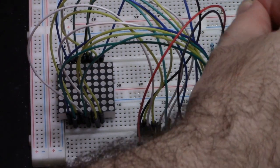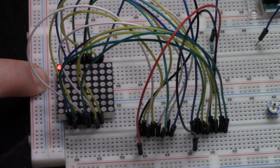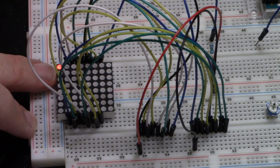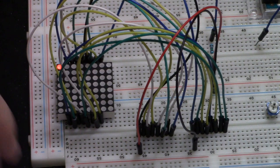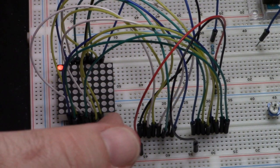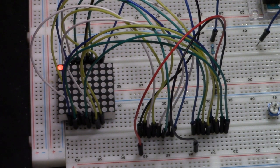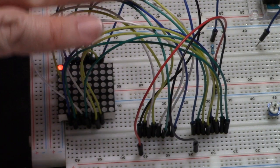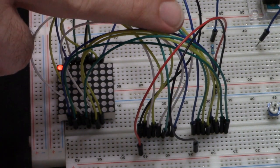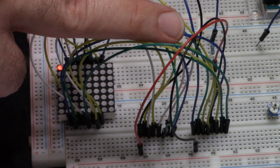Now, if you're flashing it, you actually can do more with less, because you can drive it brighter with less power, because you give it time to cool down, so there's that. But, yeah, this thing actually wants bigger resistors. The final thing to note, I measured. When I had a 15K resistor, I measured 1.74 volts. That's right, only 1.74 volts across the LED. When I went down to a 1K resistor, it was 1.88 volts. So it's actually got a reasonably stable voltage drop, and a reasonably low voltage drop for how bright it is.